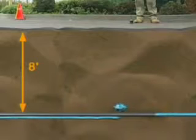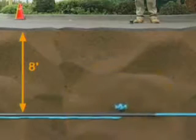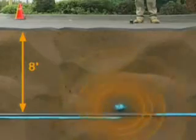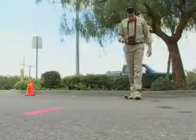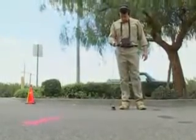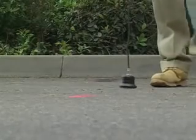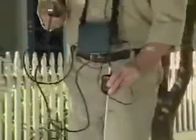And of course, the deeper the pipe, the harder it is to find the leak. To find leaks in lines buried deeper than 8 feet, increase the water pressure to amplify the sound. The surface material also affects the amplification of leak noises. A hard surface like concrete will resonate with the sound of a leak for 5 to 10 feet around the water pipe, while grass and earth do not amplify leak noise. Select the proper sensor for the surface on which you're locating.